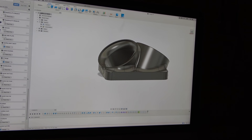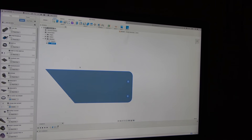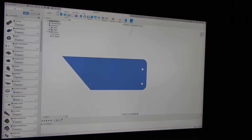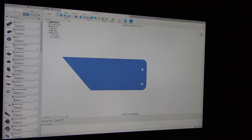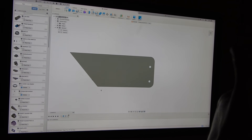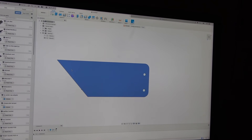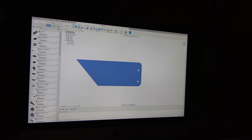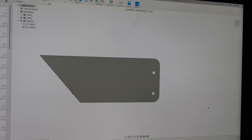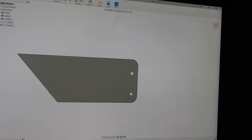In Fusion we've done a few other parts - here are the motor plates for Slick Rick. This right here is the angle of the tube. I'm not going to blow these holes out with the laser just because I'd rather drill them after - put the motor plate in, bolt it in, and drill through that so you use the tube as an indexing guide. That way you know you get it absolutely perfect and you're not limited by hey this was cut in the wrong spot. These plates are going to be symmetrical. I want to keep the motor plate as strong as possible so we're going to keep it solid.